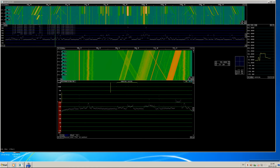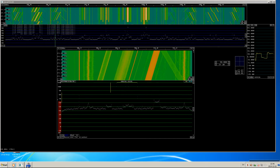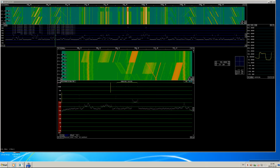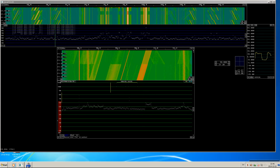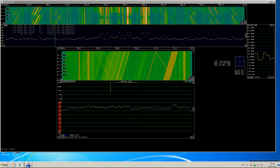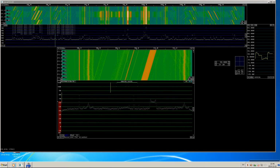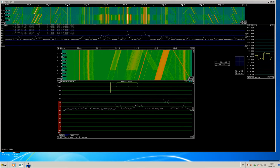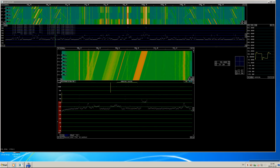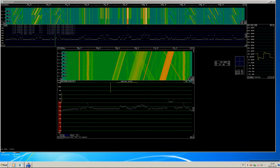Now, to understand the order of things, I reduce the amplitude by 10 dB at 98.3 megahertz. And they go down by 10 dB, it seems. 10 dB. I go up 10 more dB. There. And that's odd, isn't it? So I go down and down again, and it will be more visible if I stop the sweeping, or I make the sweeping much smaller. This is now sweeping half a megahertz. I make the span 0.05 megahertz instead.